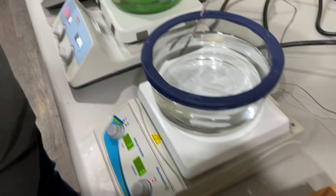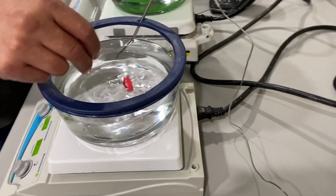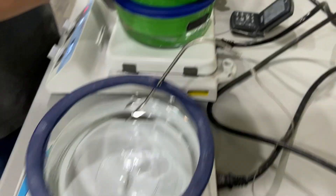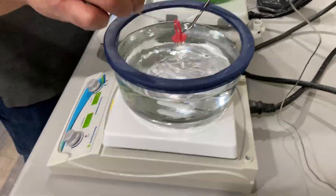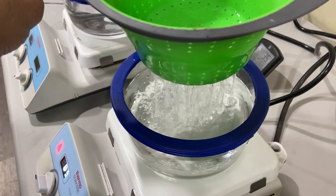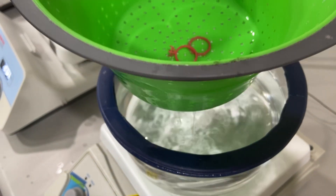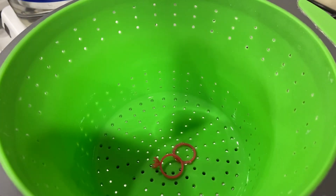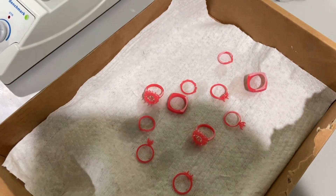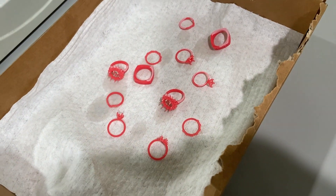Take note: when the models are in the warm alcohol they're at their most delicate and fragile state. Rinse, then set to dry. The other option is you can take the basket out when they're finished, go in for a final rinse for a few seconds, and then you can manually pull them out or with a safety clip put them in the basket. Models sit to dry — after a minute or two they're dry and ready to go straight to production.